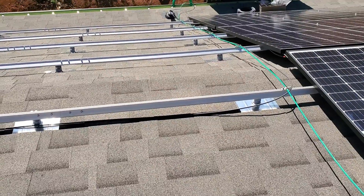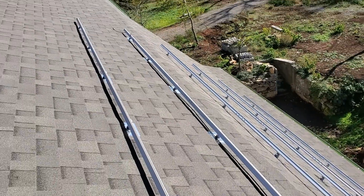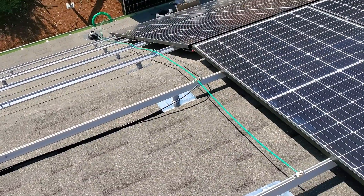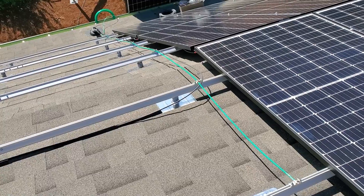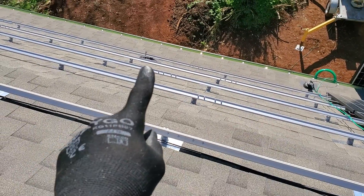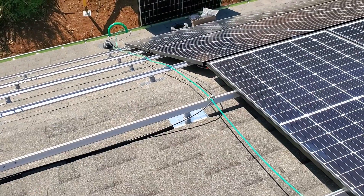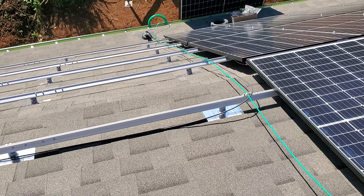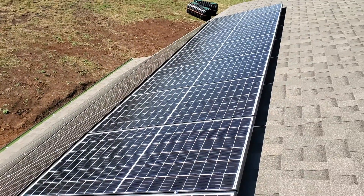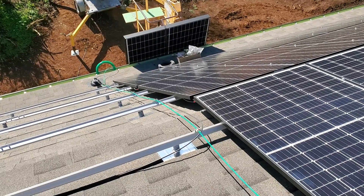I went ahead and ran my ground wire — the positive is on the west side, negative is on the east side. I pre-ran my negative wire and zip tied it down there because there's no way for me to work from that direction and line up exactly where I need to be. So I need to start here and work down, which means I have to pre-run all my wires. I forgot my tape — I need my red tape because the next spool down there is going to be my positive side. So I need to run that from this first panel all the way down into my weather head and then do the next two runs so I can basically pre-wire everything, which may save a little bit of time. We did the first panel, ran the positive wire, ran the lead all the way down and clipped them as we went — it's going to be basically the same thing.